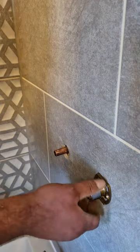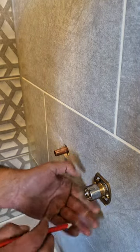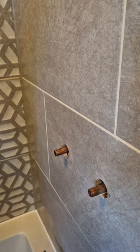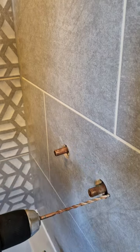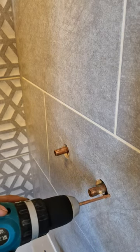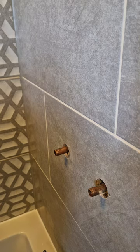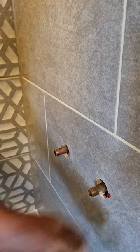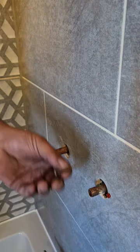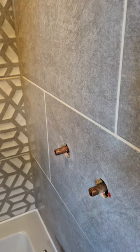So you take your first wall plate and mark your hole. This hole's a bit big there so I can only get one screw in. That's fine. With your drill bit, just press slightly until you hear a little noise — that's the tile — now the drill bit won't slip. Once you've done that, get your red plugs, put it in the wall like so. Then take your screw, put your screw in, and just give it a little tap. You always want to try and tap your plug past the tile.